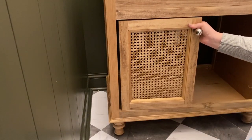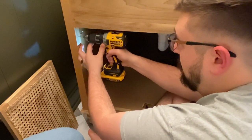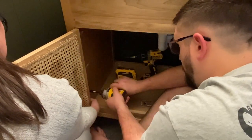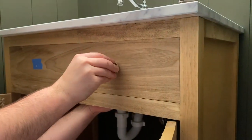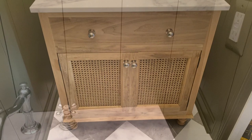With the door done, I was just far too excited to not hold it up and see what it would look like. Then we got right to it — pre-drilled the holes in the same way we did putting the hardware on the doors, and I just held up the door to ensure it would stay as level as it could while my husband attached them. Then we measured and marked where the knobs would go on the fake drawer and attached those as well.